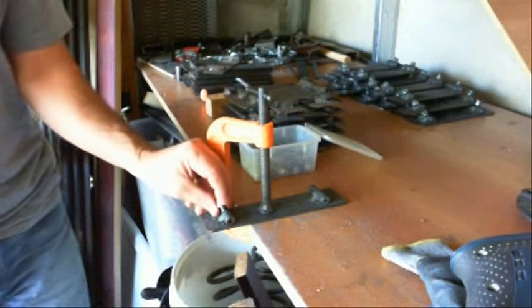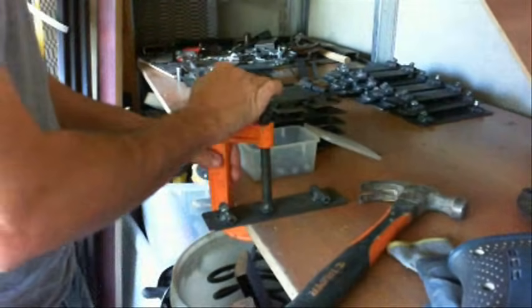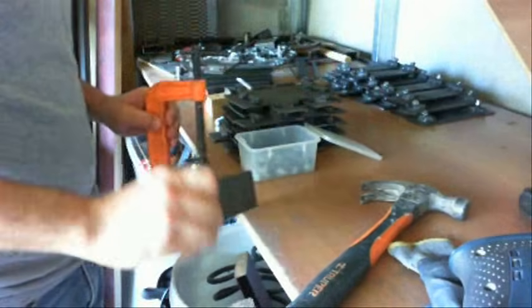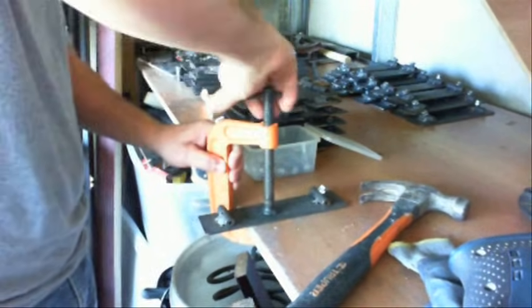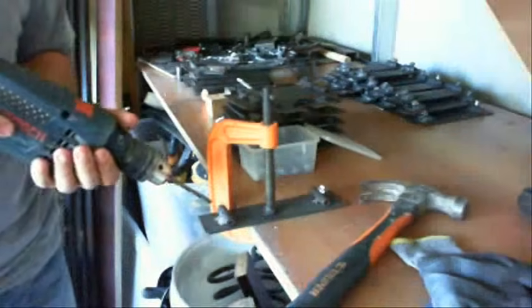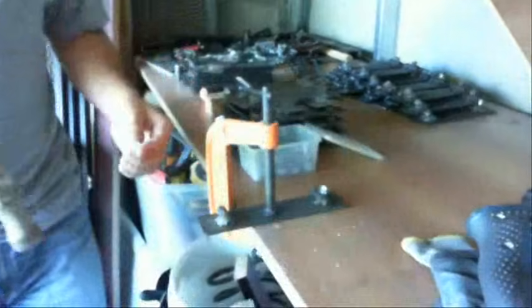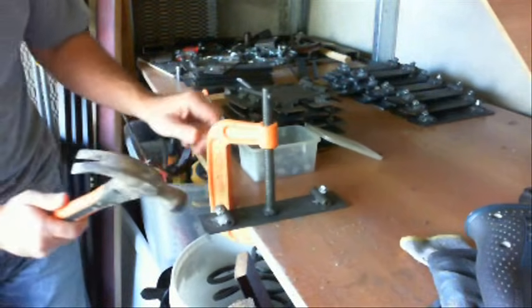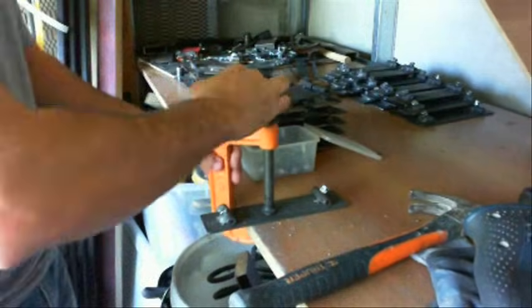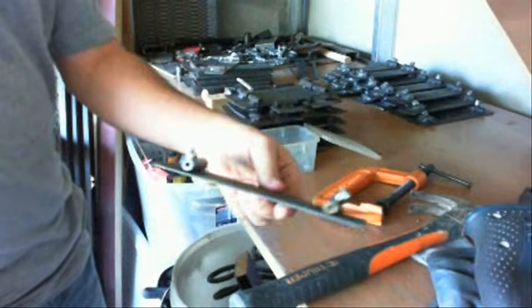Here's the 1/4 inch nut with a 1/4 by 3-1/4 inch bolt. The holes that I drill for this are just a tad smaller than the 1/4 inch bolt, so I knock them in to lock it in place. That way it makes it easier to come back and tack the nut to the top of this 3/8 inch rod. Here it is ready to get welded.